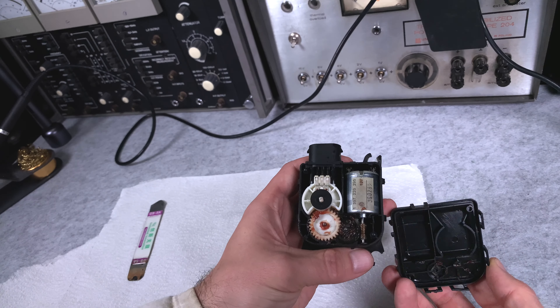I already checked the potentiometer and I know for a fact that this is our problem. What I did was attach 5 volts to those two sides and probe the oscilloscope to the center one. While rotating the potentiometer, we got a voltage spike - that tells me we've got a problem with the carbon wiper. Basically it's going to send wrong values to the computer, the computer is going to misinterpret that, and it's not going to be working properly.